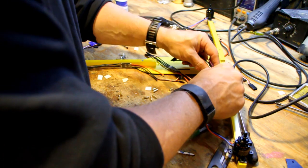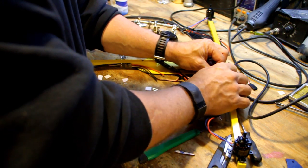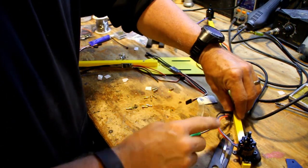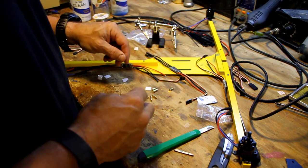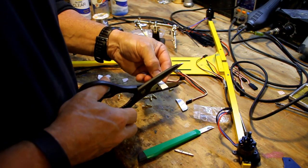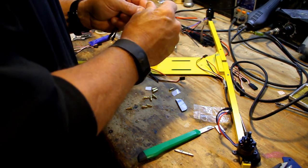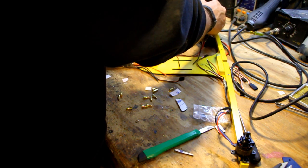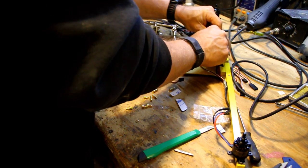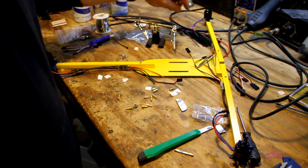What we're doing is setting up for the main wire run. I'm going to leave a little bit more wire because when we fold the arm I want it to be able to fold into the frame without having a problem — bringing it out about three quarters of an inch from the edge. When you zip tie this you'll have a little bit of play so when the motor hits the ground hard it'll have no problems. Average time to build one of these the first time is probably about two and a half hours — watch the video, do a little, watch, back up.